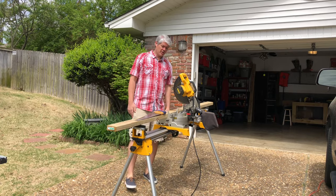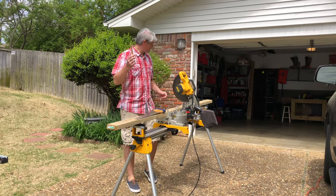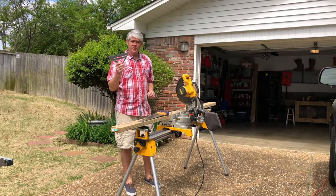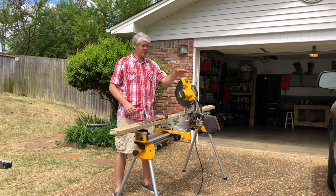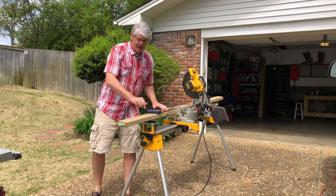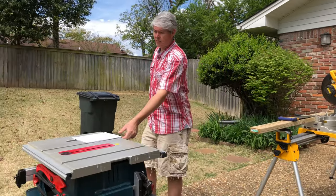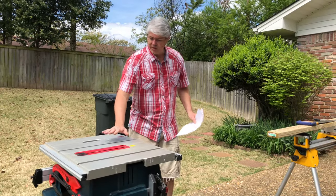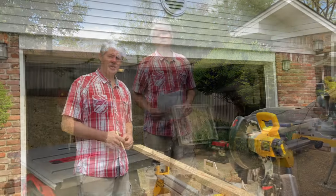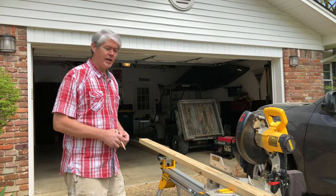The tools you're going to need are our old favorites: a pencil, tape measure, and a Swanson speed square. You're going to need some way to cross cut the wood, whether it be a miter saw or just a hand saw. We're also going to need to make a couple of rips, which could be done with either a table saw or a circular saw. Let's get started cutting those 31 and 3/4 inch long legs.